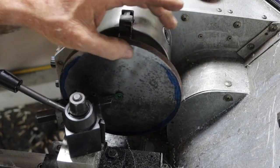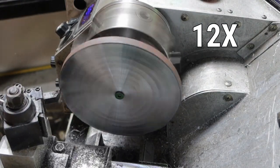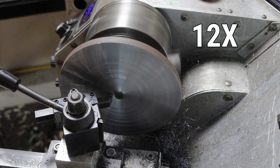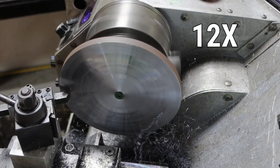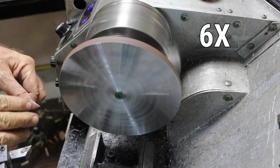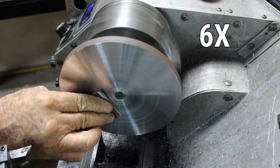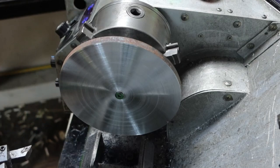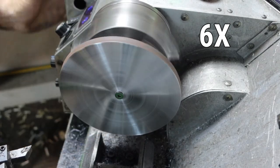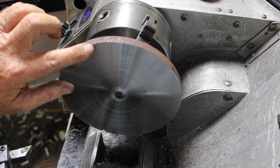Didn't do much on that pass. If it weren't for that line just there it's actually pretty decent. I want a nice finish in here since it's got to run on that piece of Teflon. I think I can live with that. Next up I'll get the rotary table on the mill and drill some holes in here.